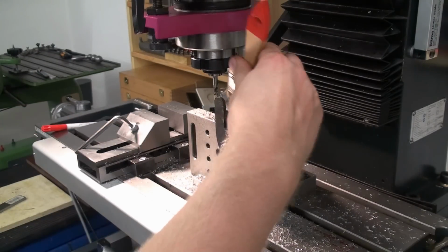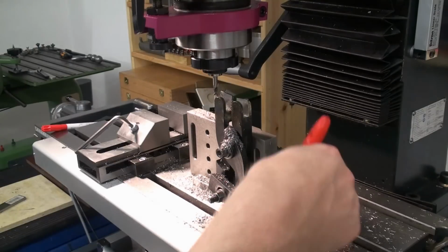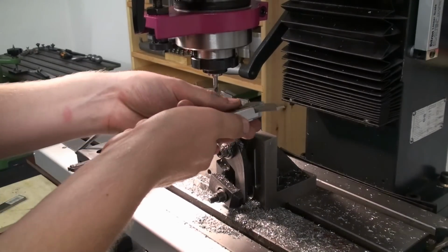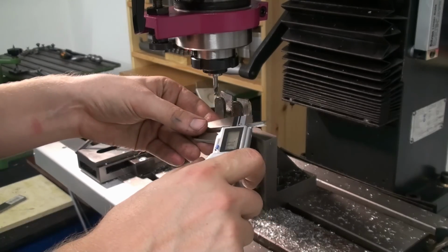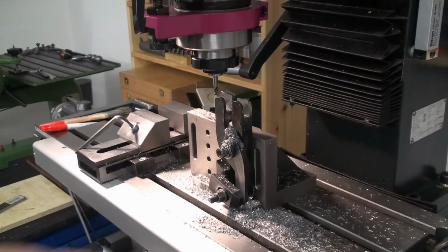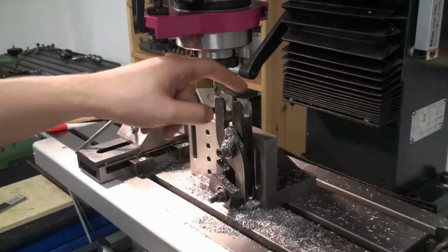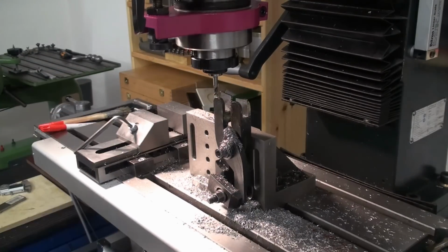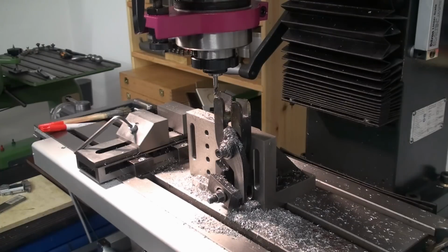And we're going to measure it right now, because you never know. Even if the DRO says that the slot should be 7.4mm, I prefer to measure it. And of course, this is only with calipers. Yeah, 7.41 millimeters. That means 0.6 millimeters are left. That means 0.3 per side. And I'm going to machine the slot to 8.05, so I have 0.05 of a millimeter wiggle room for the wheels. I will do roughing to 8.00 and then do a climb cut to 8.05 millimeters.